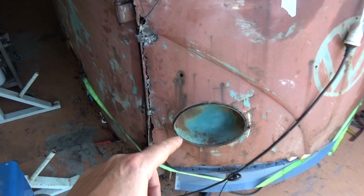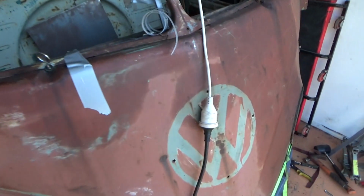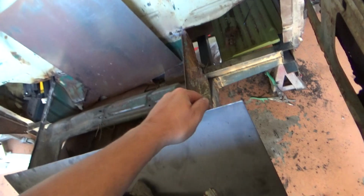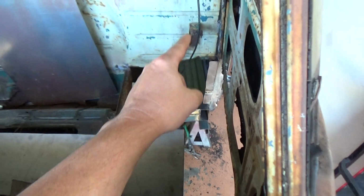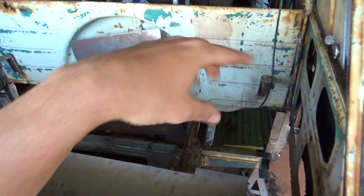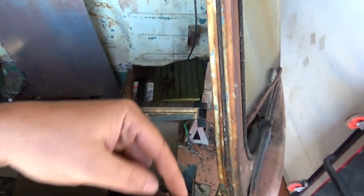There's still a few spots underneath there that I haven't welded fully yet. I wanted that flexibility just until I actually got the front section in. So down in there's a little bit of fudge room for me to lift and drop the front nose. The whole front end of the vehicle's off the ground anyway. It's only being held up underneath each corner of the frame plate. So the frame plate is a square known plane, and then everything's built off of that. So all your points come forward and then I can take measurements.